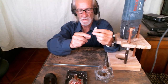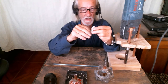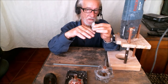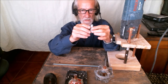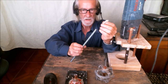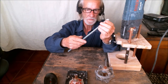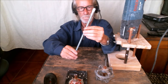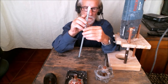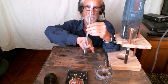Now, if I were to put in a screw here to hold something near the surface of the ceiling, it wouldn't matter if it was a bit crooked. It still would be near the ceiling. However, what I have to screw in this drop-in anchor is a threaded rod of about 1 foot long. So, a small deviation in the drop-in anchor will mean a very big deviation at the bottom of the rod.